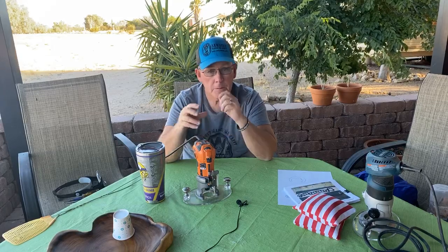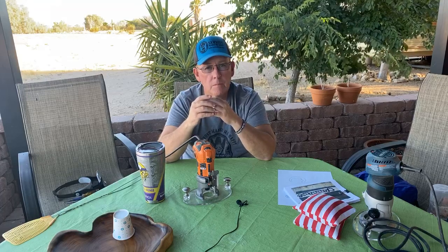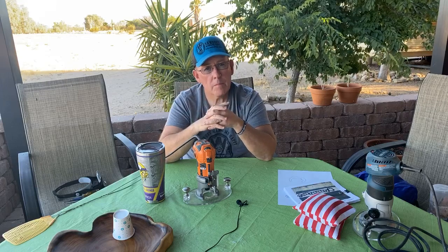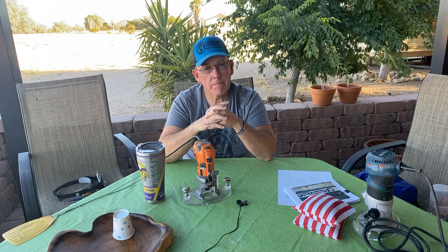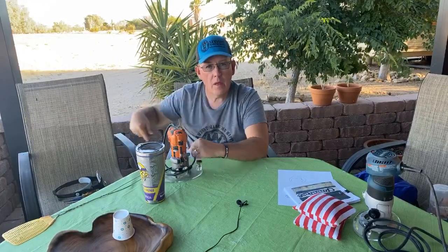Do you have to sand and polish between coats of resin, black to clear? I don't know what you mean. No, if you pour a thin layer of resin, you do need to scuff it up before you pour your second layer, but you don't have to polish and all that stuff. And the scuffing it up is to give it something to stick to for the next coat that you put on, right? Yeah, it gives it something to adhere to.